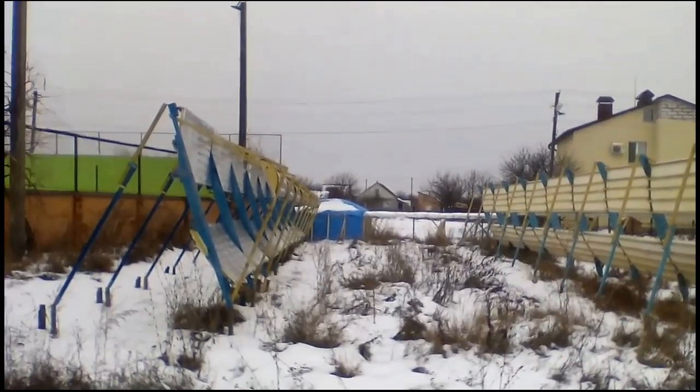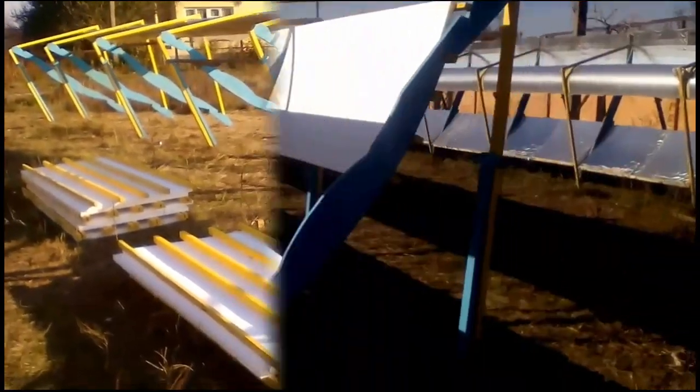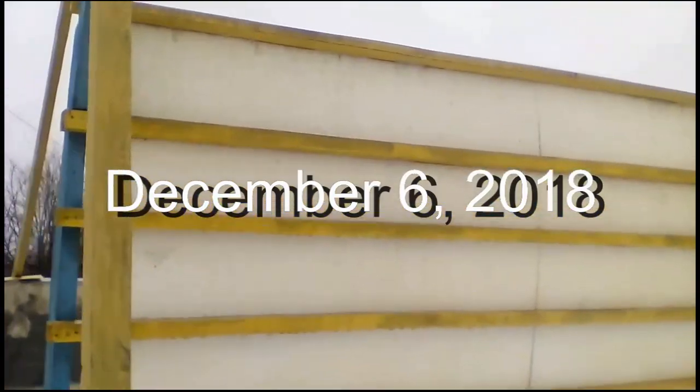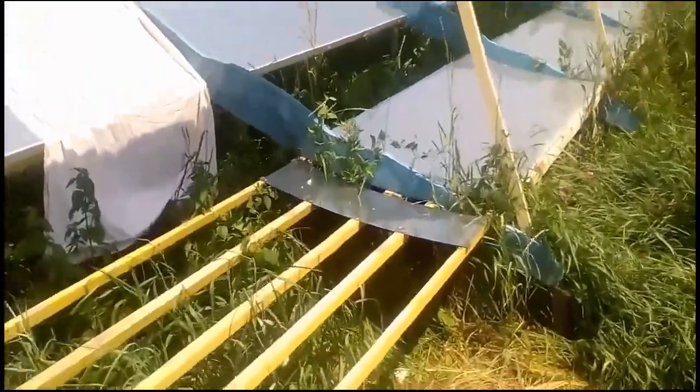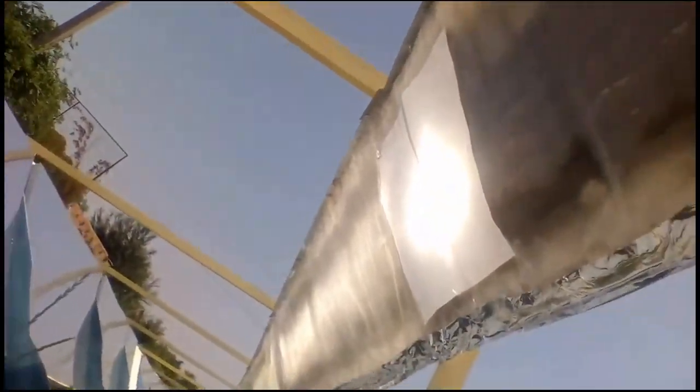I want to clarify that this first row was built 4 years ago, and now I am showing one of its first videos. This next video was made more than 2 years ago when I was building my second row, and we see platforms which will form my reflective wall. Now I show the same platforms after installing them. Each of these platforms has several wooden battens which are glued to sheets of cheap expanded polystyrene by polyurethane foam. Of course, we can replace the wooden battens with such metal profiles, and our polystyrene sheet can be replaced with a thin metal sheet, but a polystyrene sheet is several times cheaper and more convenient. We can also refuse the use of the polystyrene sheets and install our mirrors directly on the battens. However, the polystyrene sheets protect our mirrors against wind, and the polystyrene allows us to easily fix mirrors of any type using polyurethane foam.